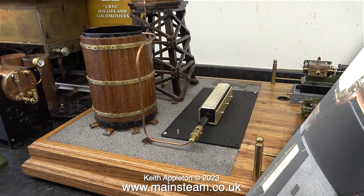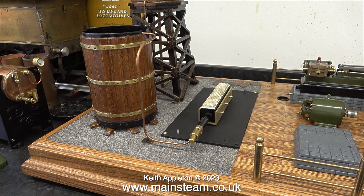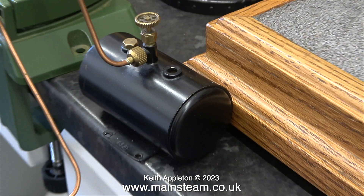Pressing it releases the liquid gas into the small gas tank. Here is the small gas tank — this one is a Cheddar Models gas tank and I've had it for quite a long time. You have to be very careful when working with this gas for two reasons: one, it's poisonous, and two, it is explosive in a confined space.